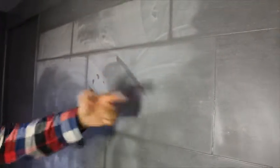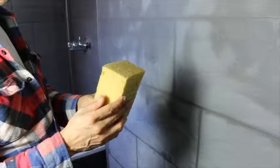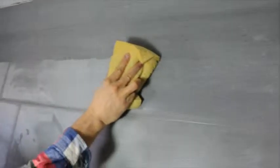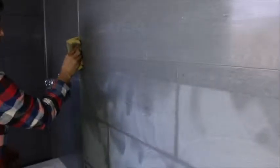We need a second sponging off because the first sponge up left a white film all over there after it's dried for about 15 minutes. If we don't get it off the same day, you won't tomorrow. Top tip: four faces to the sponge — we're going to use each face once. Wipe, lift off, turn the sponge, wipe and lift off. You'll see the dramatic difference because you're not spreading muck around. Wipe across, lift off, turn the face of the sponge, sponge on, across, off again. Then we've got the two edges of the sponge — don't forget those. Nice even pressure across, lift off, and the final face. All tilers clean this film off this way.